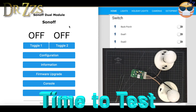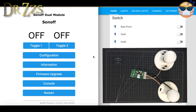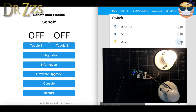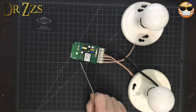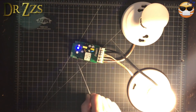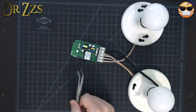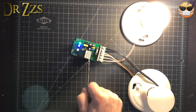I have my Sonoff Dual original connected with Tasmota configured as a Sonoff Dual original. If I use the toggle buttons on Tasmota's control page or the Home Assistant switches I created, it will turn the lights on and off — that works fine. Unfortunately, if you go to the board itself and try to use the Button 0 or Button 1 pins to activate the relays, they do not work. Sometimes it turns one on, sometimes the other, sometimes both on then both off. It's really unpredictable and not very useful.